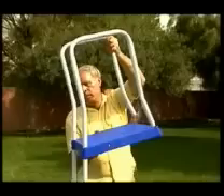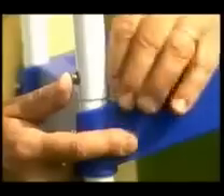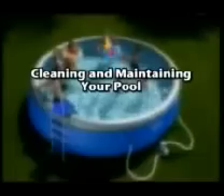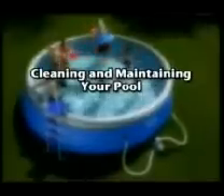If you have a 48 inch or 121 centimeter ladder, follow the previous steps to assemble the legs and then attach the support board, inserting the screws but do not tighten. Next, attach the curved handles and insert the screws — again, don't tighten. Connect the remaining legs and tighten all screws. Please note, refer to the printed manual to determine which hardware to use and where. To complete assembly, fix the warning boards to the platform.